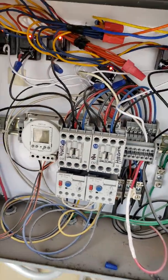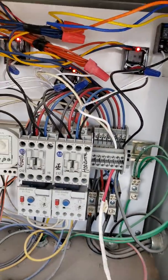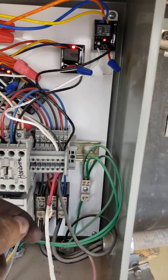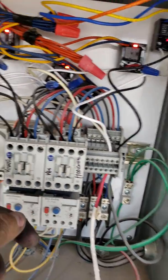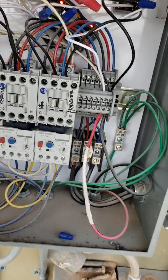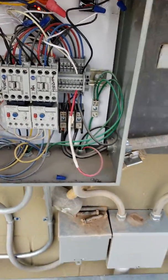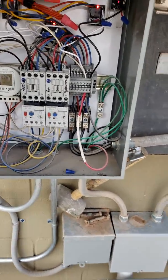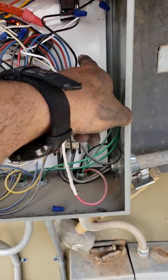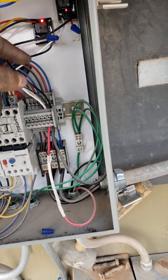All right, so you have a 3-leg hot. Okay, so 1, 2, 3, but what I'm doing, because I'm anal retentive, hot 1, 2, 3, 4, 5, 6. Okay, and this guy's its own breaker. That's the timer. It's 7. Okay, so you got 7 hots to deal with. But at the end of the day, if you really wanted to just, I don't know why. I mean, being anal retentive when it comes to this stuff, or it's going to cost you money. I mean, technically, all you have to do is just monitor the first, blue, red, black, some kind of combination.